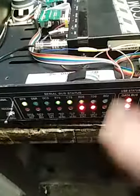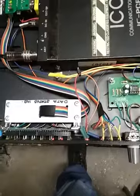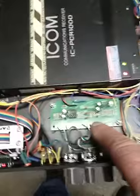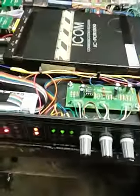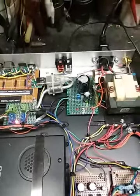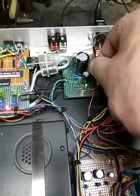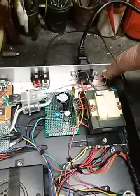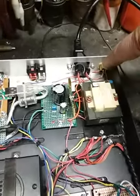Let's go inside quickly. Here's all the breakout circuitry for the serial — we're just bringing everything over on a ribbon cable. That's high-level digital so I'm not really worried; it's averaging plus and minus 12 to 14 volts in serial format. We're doing tone compensation, a little 386 power amp, and all the A-to-D and D-to-A audio conversion to drive these logic-level idiot lights. A very clean power supply — two or three millivolts of ripple or hash on that supply; it's clean and it's warm, but not hot. Auxiliary power in or out, 12 volts, to drive your laptop, charge your tablet, or feed this out in the field from a 12-volt battery or generator.